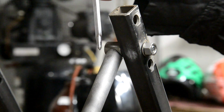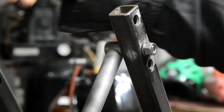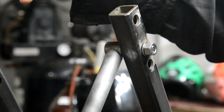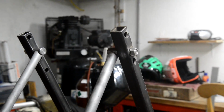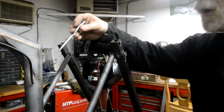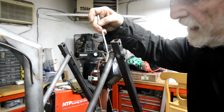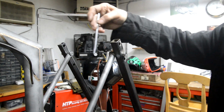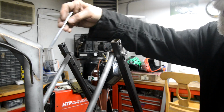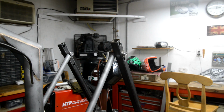It's got to be at an angle. It's got all sorts of bits and pieces. So I'll probably do these. The one at this side is going to be easy. It's hardly going to be anything, being 3/4 tube onto 1 3/4. That's just the least little curve. Here I'm going to have to get clever. And I think it would be too much to try and bring it out here and then bend it in. So I'm just going to bring it straight to there, and then we'll make a loop for the back. All right, so let me tack these.